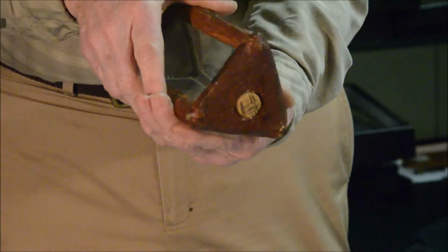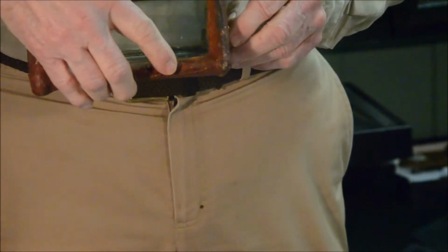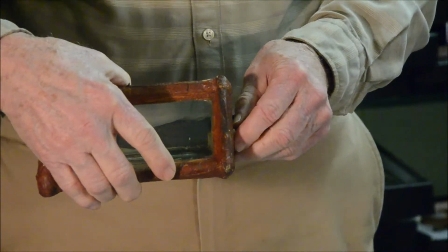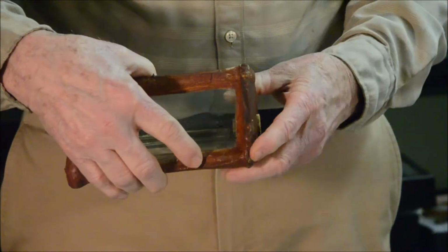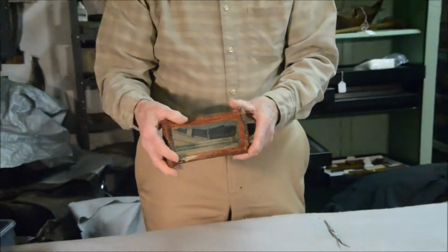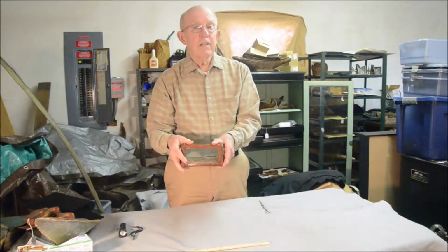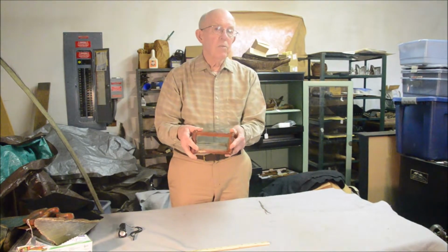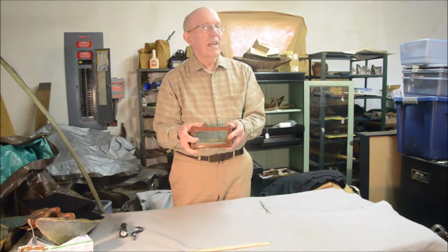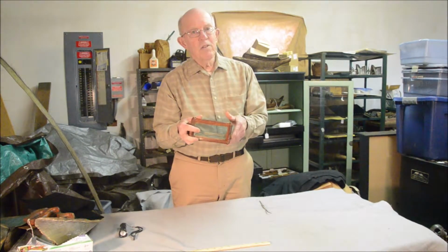To use it as an artificial horizon, what you want to do is put something in there that will reflect light, and that something is usually mercury, liquid mercury. Can't use it today, but in the old days they used liquid mercury. You could also use something that's relatively reflective, and in the Arctic, for example, early Arctic explorers resorted to using molasses. Molasses is sort of easier to use than mercury.